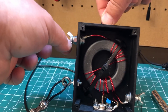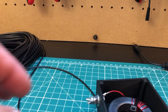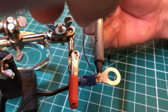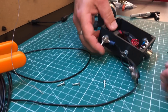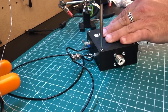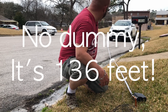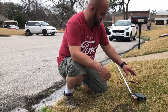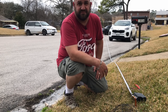This can attach here safely without putting strain on the antenna or on that part, because it's gonna hang from this. If we didn't put this strain relief, the wire is just gonna pull that connector. So let's crimp and solder our ring terminal on here. I measured out 168 feet of wire, just ran it back and forth, and I'm gonna put another one of those little metal clippy things on this side and make a loop.